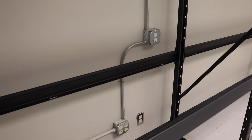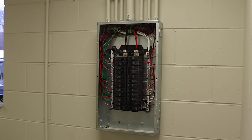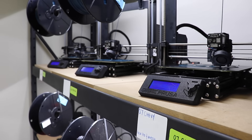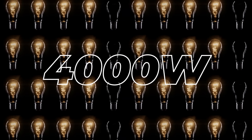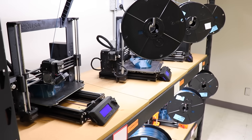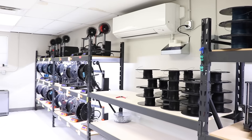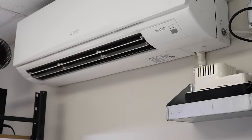I've got 11 20-amp circuits in this print room, which I installed before moving in here. It was definitely overkill when I just had 25 printers, but as my farm scales, I'm more and more thankful I already have this set up. Since most of that power is eventually turned into heat, each printer gives off about as much heat as a 100-watt incandescent light bulb — so 4,000 watts of heat is very toasty. This room is normally at least 10 to 15 degrees warmer than the main area. The mini-split installed in this room is great because I can turn it on while I'm working and off when I leave. Making sure your space can handle the energy input and removal is key.